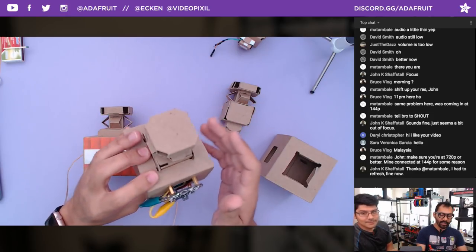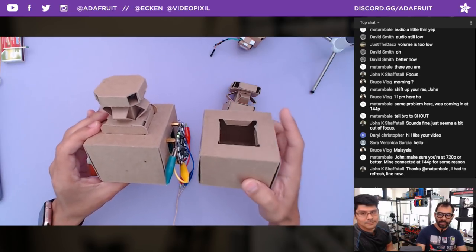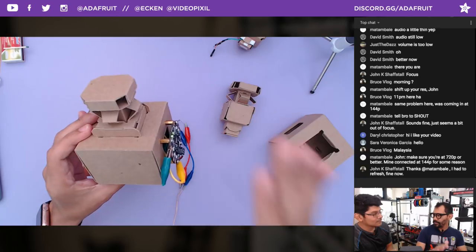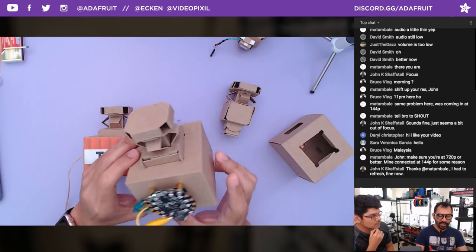For this one, we did have to modify it so we could actuate buttons on the Circuit Playground Express. Super easy — the stem on the bottom has a copper tape that makes contact with the rest of the circuit and completes it, allowing you to have button inputs onto the Circuit Playground Express. You can build a bigger box with a bunch of buttons to use as a musical instrument or audio box.